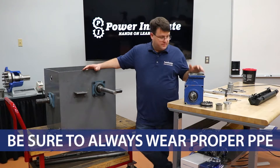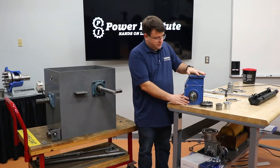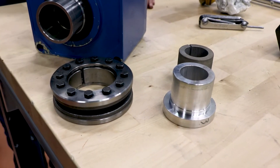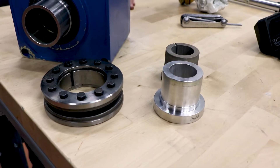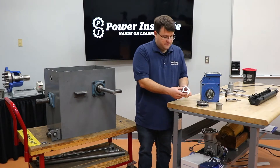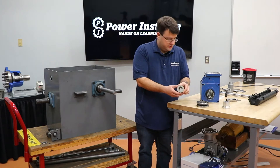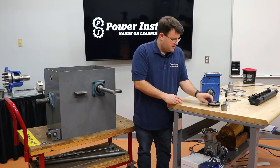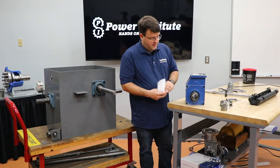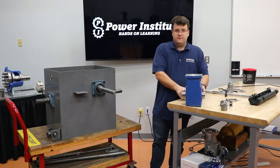The first thing we're going to start with is our easy grip. So we have our easy grip reducer here — this is just a demo, this is just the reducer portion, the motor would be sitting here. Just to go over our components: we have our shrink disc itself, two plates with all the hardware — make sure they're all loose. You have your inner support bushing with the locking collar built into it, and you also have your outer support bushing. To get started, we'll prep the unit first. We'll take the unit on the bench and clean the surface where the shrink disc will be sitting, which is the outer larger extension of the two.